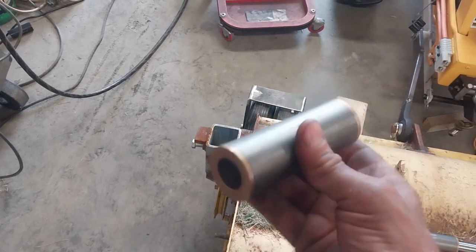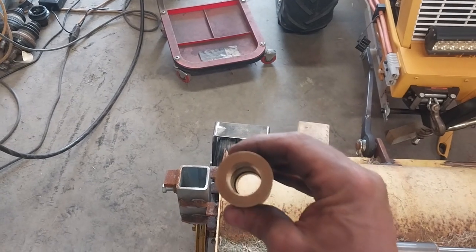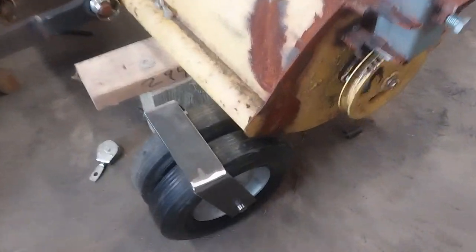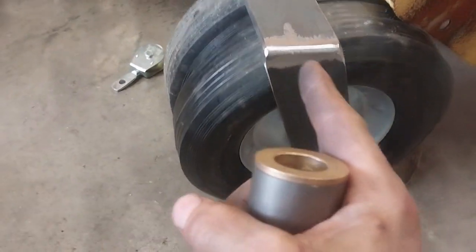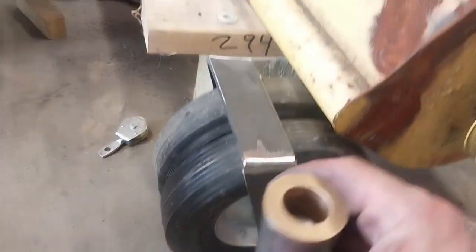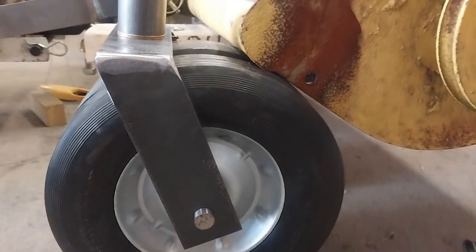I went to work and got on the big lathe, hogged out a piece of one-and-a-half inch tube rod, put some bushings in there, and that's going to be my casters. Today I built these little dudes. I went online to figure out the optimal caster angle — turns out the center of the pivot to the center of the wheel should be about two and a half to three and a half inches. I grabbed somewhere in the middle, so that's going to work pretty good, I think.